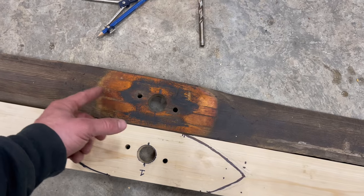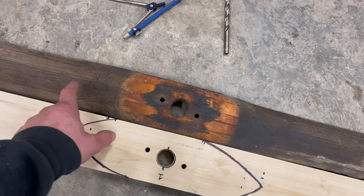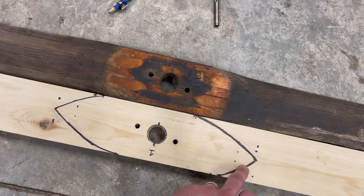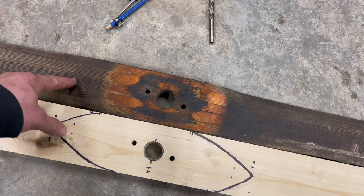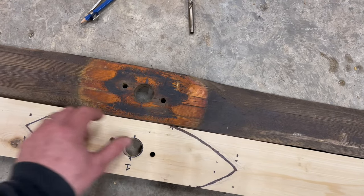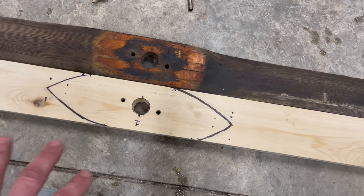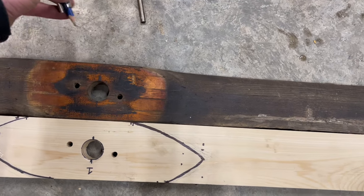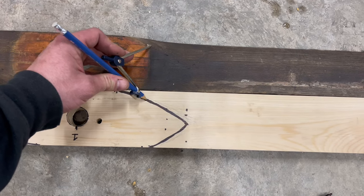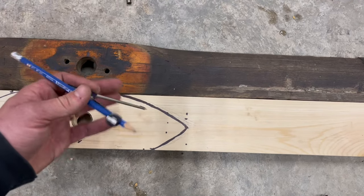And I measured, and I was within about a quarter inch of these end marks, which could really vary anyways where this tapers down. So I measured it, came up with 29.5 or whatever it was, and I marked on each side at 29.5. And then I measured to my last mark here where I saw on both sides they were opposite from each other, and this was 2 inches, this was 2 inches. So I just came up with the 2 inches. I put a dot here and here, and then I took out my scribe again and I ran it down, got it square here with a square, and then I ran it down roughly like this. I'm just looking into the camera, and I went like this until it dropped off, and then I came back. And that's roughly what I got with my pencil marks.